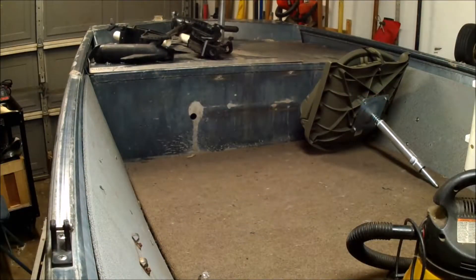The deck in the boat right now is plywood covered in carpet, which we know is going to rot in a saltwater environment. So to head that off, I'm going to rip it out and replace the deck with aluminum sheeting. All of the interior will be finished with self-etching primer and then painted white with non-skid.